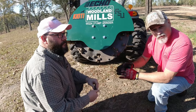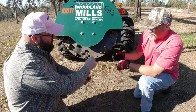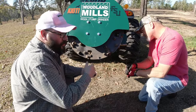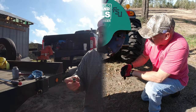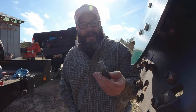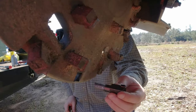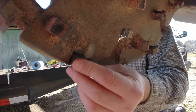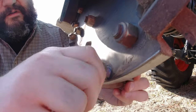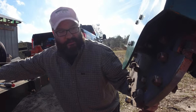Now that we've got the flat orientation tooth removed, we'll put the new one in and then move to the 45-degree orientation. There are only three orientations — they're kind of staggered different ways. What we're going to do is use anti-seize on the tooth. Woodland Mills doesn't exactly say it's necessary, but it's preventative so it's not going to get stuck in the hole and makes it easy to knock out. We have to make sure we get our orientation right, put it in the hole, put our nut on the backside of it — watch out for the anti-seize — then put our pry bar in and torque this to 160 foot pounds.